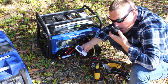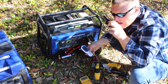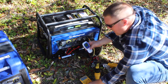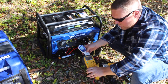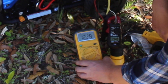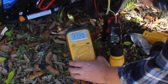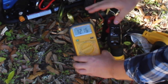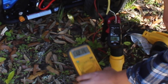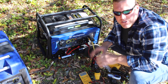All right, shut it off — let's run it again. Put it back on right away: four amps with just the fan. We'll watch when the compressor kicks on and see the voltage drop — just a brief drop to 118 volts, then back up to 120. Now reading 13.5 to 14 amps.